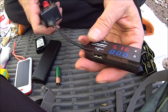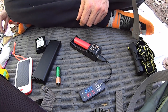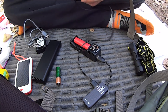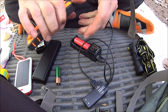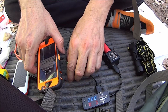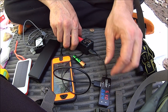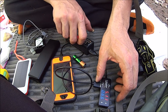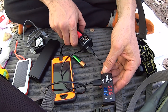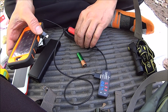It's showing 5.15, 5.16 volts — that's just fine. So we're charging at around one amp. That's good. It'll drop back down as it settles, but that's exactly what I would expect. There it goes, it's going down now, but that's normal. If I use the phone, it'll go up because the phone is drawing in more energy.